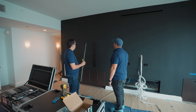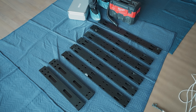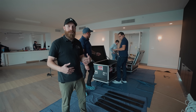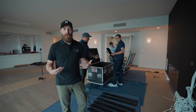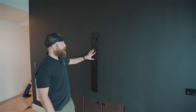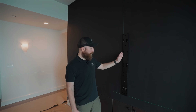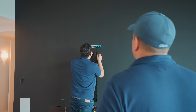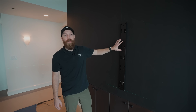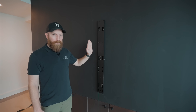The next thing you're going to do is start preparing your bracket materials to go on the wall. What we like to do is get all of our inventory of brackets and lay them out on the wall before we start mounting things — that way it's easy for us to align them all properly without having to dig through crates every single time. We have our first bracket up and we've taken great care to ensure that it's perfectly aligned with our laser, because if this is off by even one degree, it can result in a much greater difference as we go down the line and install all the rest of the bracket tree and then the cabinets.